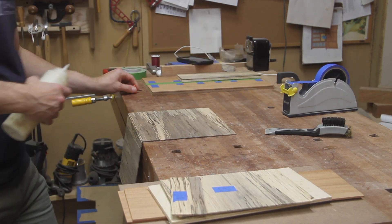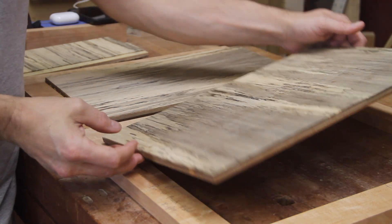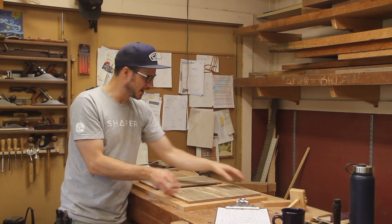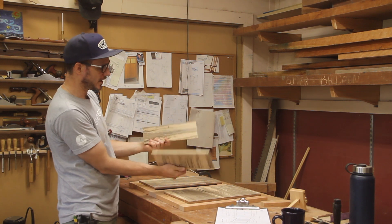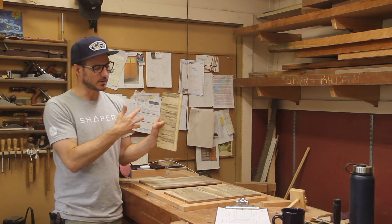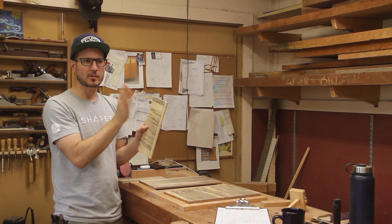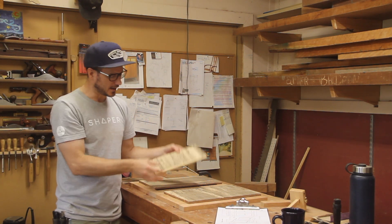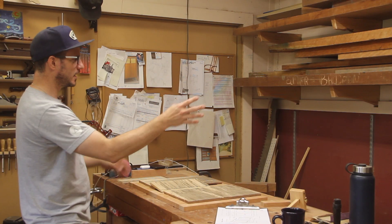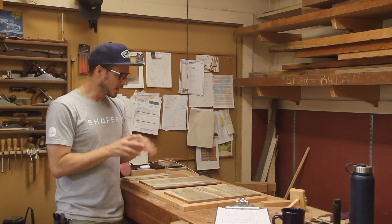For instance, the back panels — I've got this left panel and it's some crazy spalted wood running vertical, and then the open one is going to run horizontal, which is kind of fun. These are the door panels, and I used a quarter-inch Baltic birch as the core, making sure the orientation is always perpendicular — that 90-degree plywood orientation keeps it a lot flatter. This grain is a continuation of the back panel, so when you look through the cabinet it's a continuation through the door.